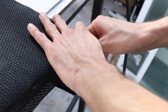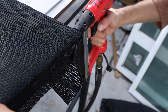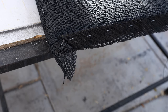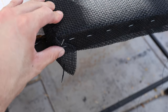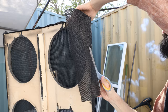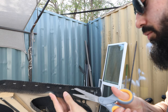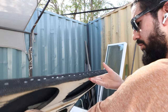For the corner pieces you want to get a weird triangle fold — you have the side flap and the bottom flap, and you kind of want to pinch that down. It's best to have a burnishing tool. I like the tension of the grill cloth, so I'm just going to seal these edges, get both ends, and staple it all down. If you have a little bit overhanging you can just cut that right off — it won't do any harm. That's the finished cloth.